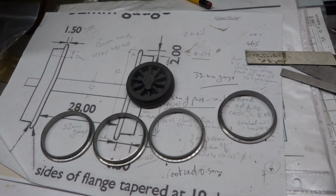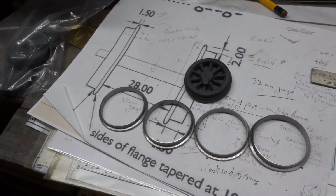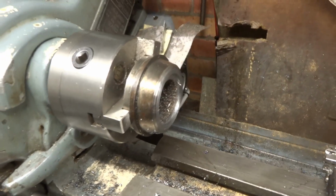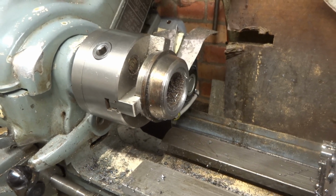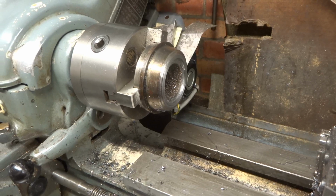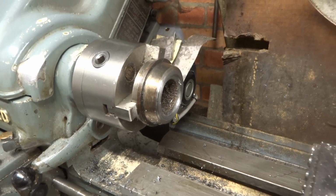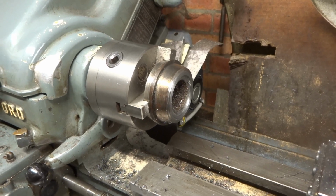And the reason is the steel. Whatever this old hub, from which I got this lot, whatever that's made of, I can assure you is not free machining mild steel. And I suppose with hindsight one might have expected that. And the sheer difficulty of getting through it, I don't know how many carbide tips I've broken, can't adequately be explained.